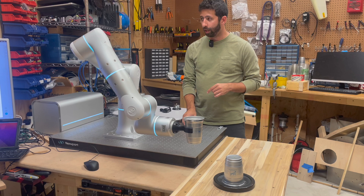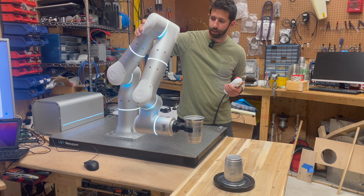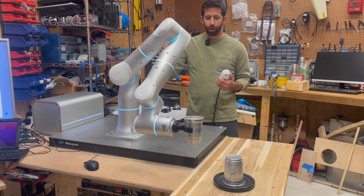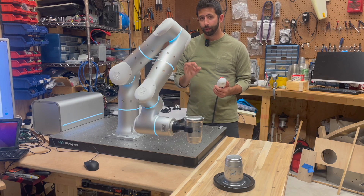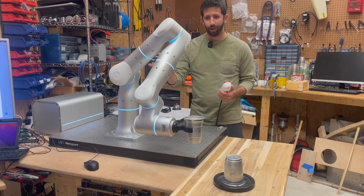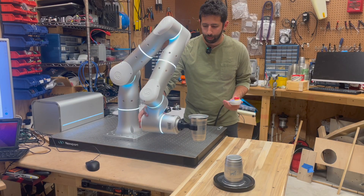I have null space turned on such that in free drive mode when I pull this switch, I can reorient this joint. Now it's coming back toward me — this is where it was after I picked up that cup with the elbow being backwards toward me. Now I'm going to unlock the XYZ of the world origin so I can do those linear movements. I've unlocked the X, Y, and Z axis. Let's go ahead and put it in free drive mode.